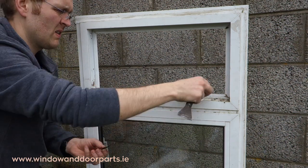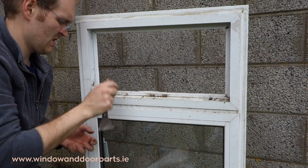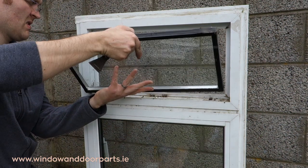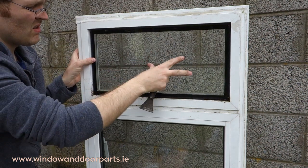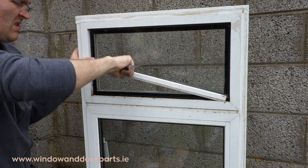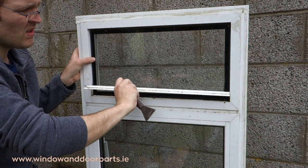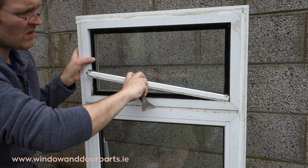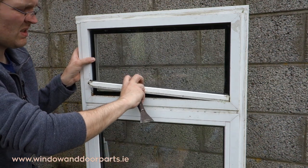See these pieces of plastic — you might be tempted to throw them out, but these are so important. The double glazing sits on top of these. There are a couple of reasons you need these, but the main reason is so you don't break the glazing when refitting. As you refit the rubber glazing seals it pushes the double glazed unit out against the glazing bead. If these packers aren't there the double glazing gets caught in the bottom of the sash as it's being pushed out and breaks the glass.